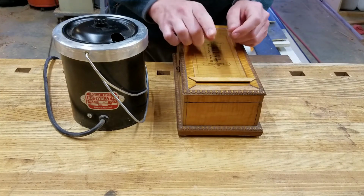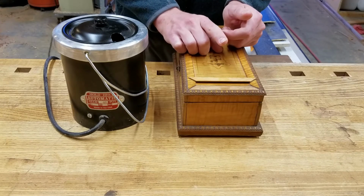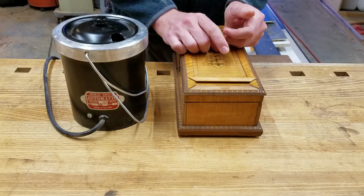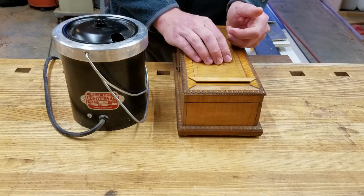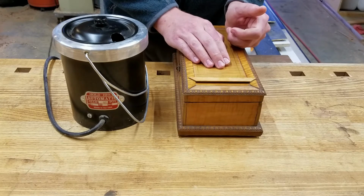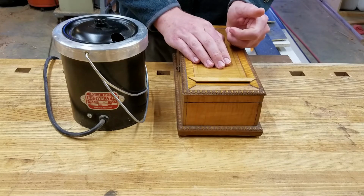But that vinyl is flexible, so the glue line can creep, and it's irreversible in most situations, as well as being a one-off thing. PVA glue can bond two pieces of wood together once, but even if you manage to separate them cleanly at the glue line, which is unlikely, you can't ever use PVA to bond them again.